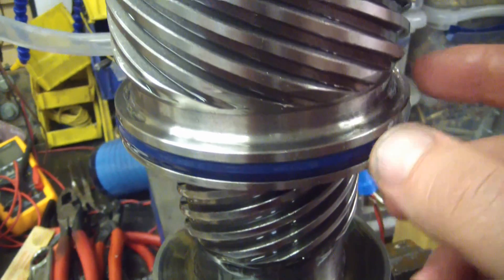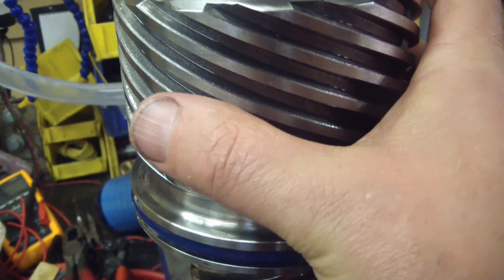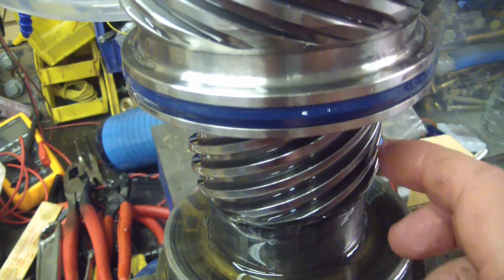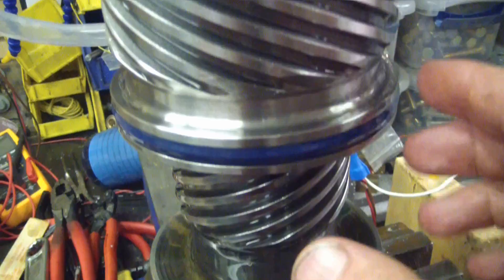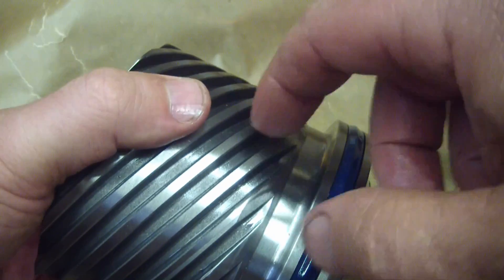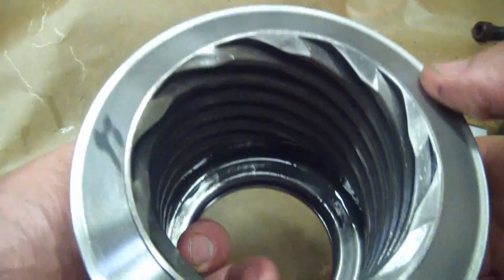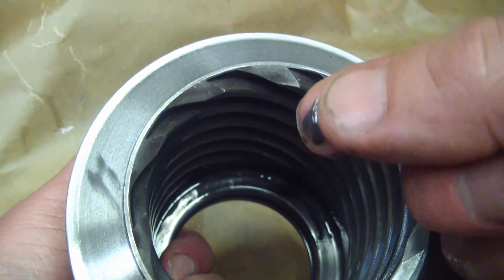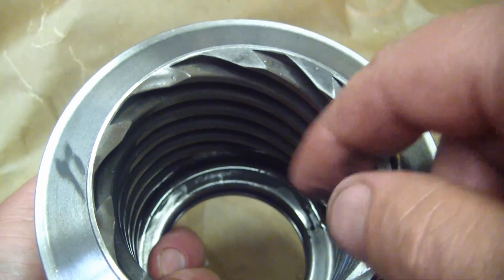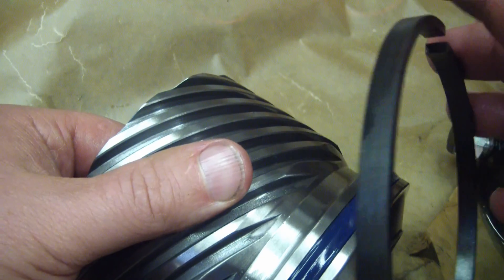So this is the actual moving piston — this is the intermediate piece. This is the piston — the thing that moves. The outside is the case; it's held stationary. I can't quite get my head around how this actually turns the thing — I might need to go to an animation. But essentially this moves up, it's held against the outside so it has to turn, which in turn makes the output turn. I had a good look at all the helical gear teeth and they're all fine. There is some contamination — some shmoo in the hydraulic system that accumulated there. No metallic particles in the shmoo, however there are some tiny metallic particles in the seals and embedded in the wear ring.